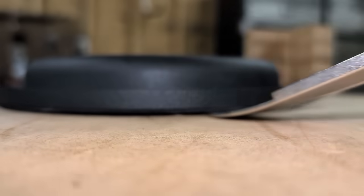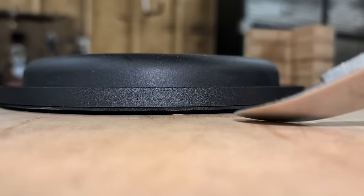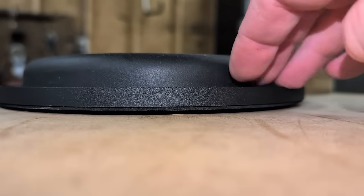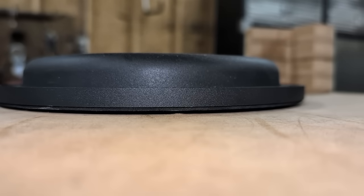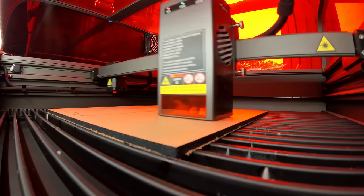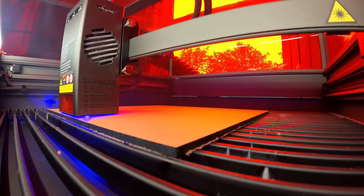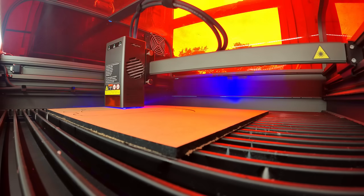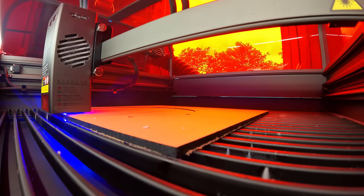Not sure how well you can see that, but there it is right there — I've got an air leak right there. My cutout was a tad bit undersized. I always say you should do a test fit on your baffles before you start assembling things. I didn't do that this time — I didn't think I needed to; I had the measurements from the manual, I had a CNC machine. That just goes to show you, you always do a test fit. There's always just a little bit of variance in the manufacturing process.